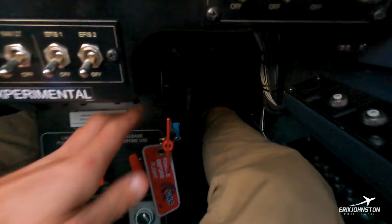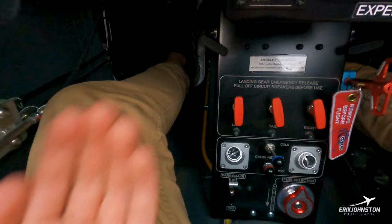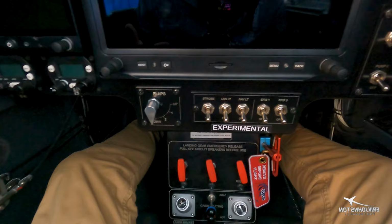The rudder pedal in the front, it's a little bit dark now. Maybe you can see it a little bit. Here you have a black lever, and here is another black lever. If you pull that one, it goes forward or to your end. And if you pull it and you push in the rudder, you can slide it back. And this is how we can adjust the cockpit to fit people up to 6.9 feet. So very huge people can fit that airplane.